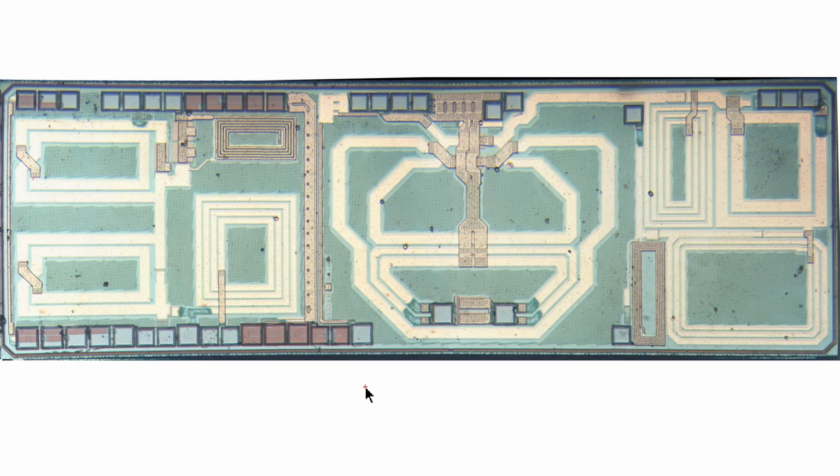I kind of suggested maybe it'd be a charge pump producing that high voltage, but clearly that is not the case. That's a pretty time-honored way of creating about 20 volts. You just do a series of capacitors and diodes, but these are definitely not those. These are inductors, of course, all sorts. One here, of course, one here, smaller one here, and same thing on this side. Because it's meant for dual channel or stereo application, it looks like these are sort of mirrored.